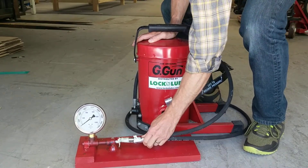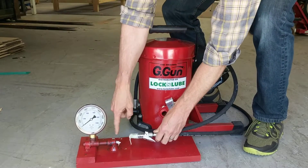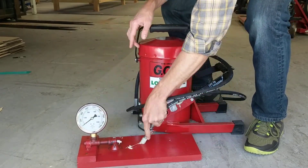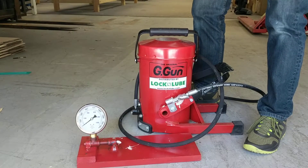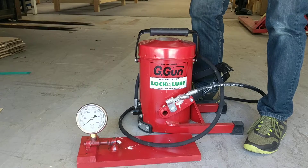Pick this off — a little bit of grease is coming out of the pressure gauge because of all the back pressure, but the coupler barely leaks. And just like that, we get off a clogged grease fitting at 10,000 psi with no mess.